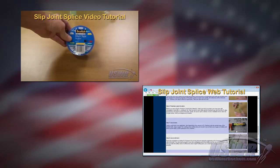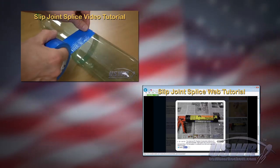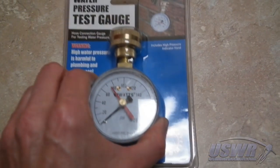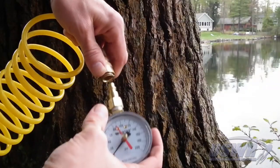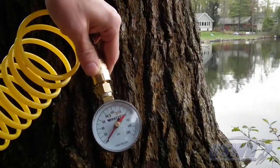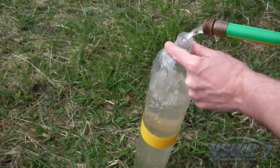This video demonstrates the performance testing we conducted on a pair of 1.5 liter seltzer bottles joined with this technique. For the test, we purchased a 200 psi pressure gauge and mounted it on a hose so that it could be positioned in view of the camera to record the pressure during the test.